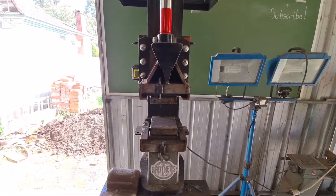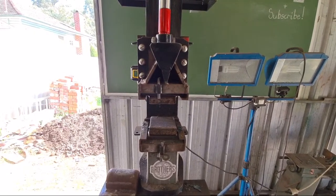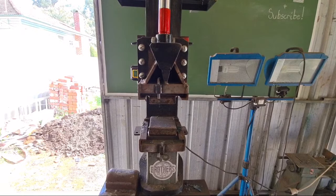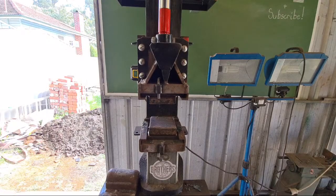For drawing out the shorter side of the steel, well, yeah, clearance for your knuckles is a good idea, but mainly that's basically it. It can be somewhat to do with balance. The further away the weight is from the handle, the more direction you have in the swing. So that can help.